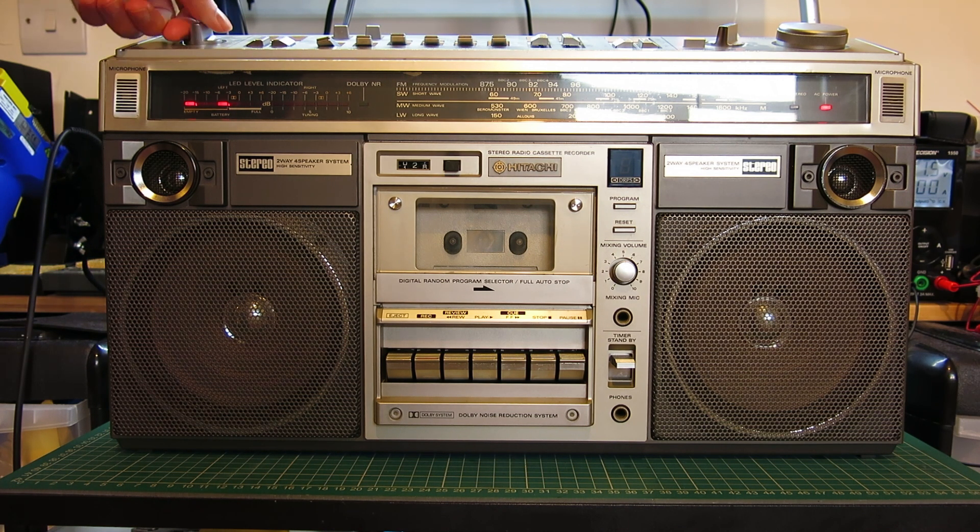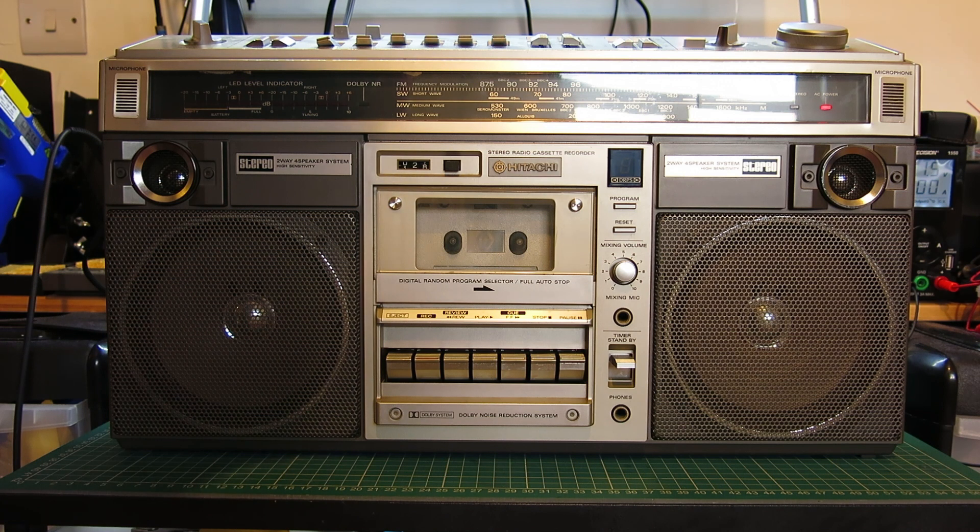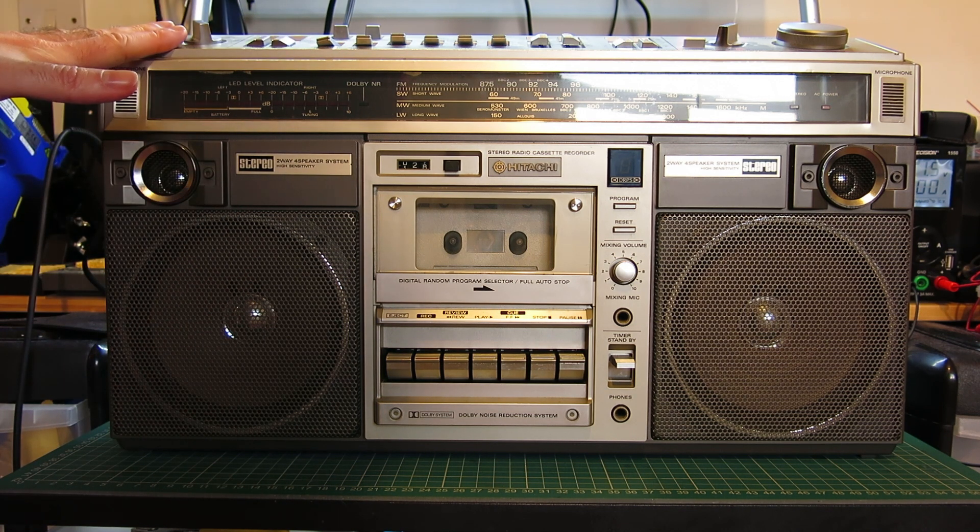Something's definitely up — look how weak that signal is coming on. Lost audio. So either we've got a supply or demand issue: either something's gone wrong in the circuit at the back by the transformers and it's not supplying enough, or there's something pulling the supply down. We'll do some measurements and run it from the current-limited bench supply. We'll be able to tell if it's drawing more than it should, and we'll disconnect the power and meter the output from the transformer circuit separately.